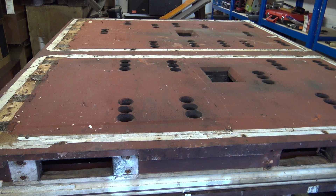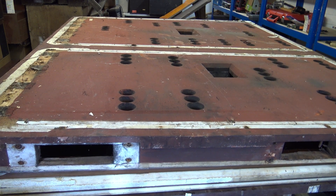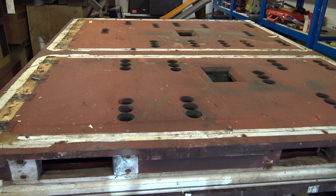This is a double-rise bellows — remember this is upside down, so that's the top. You've got a floating frame and two bellow sections. The reason it's upside down is because in time gone by there have been feeders on the bottom which would have been operated by a hand handle to pump the thing by hand.